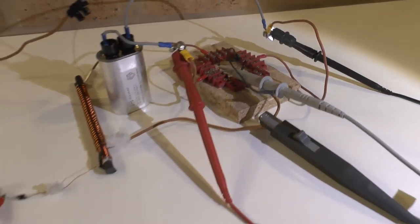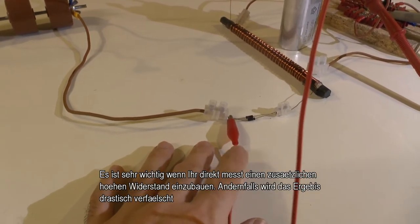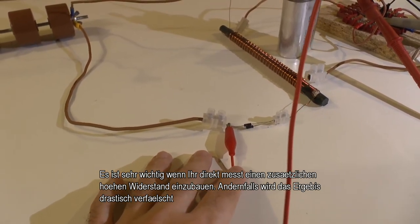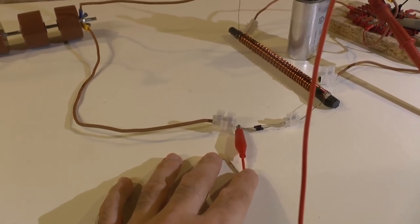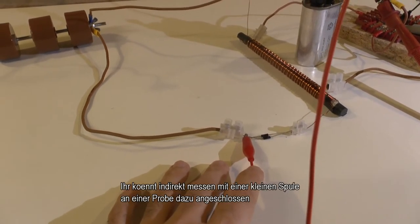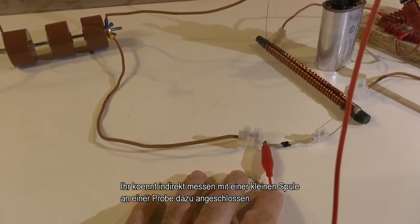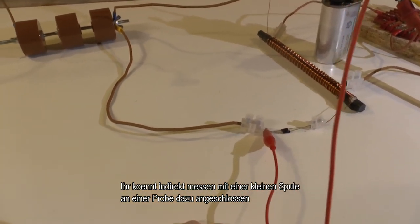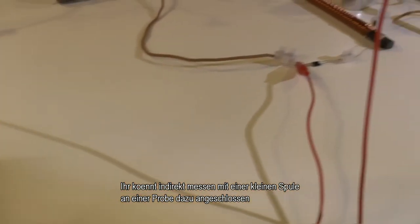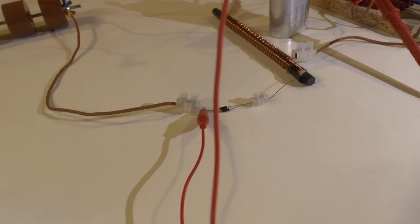Just for information: measuring on the first side is a dangerous part. This is not only because of the high voltage but because of the influence it has on your complete tuning of the system — you have to really make sure to isolate it. You can measure with a coil at a distance to capture the RF frequency and measure the peak that way, or here in my example I use a 1 megaohm resistor in between just to isolate it even further. Otherwise it influences your complete measurement and you get false readings. You have to be very careful.